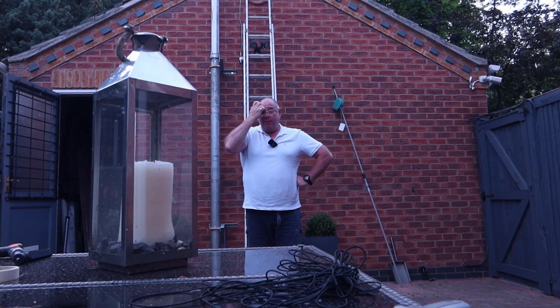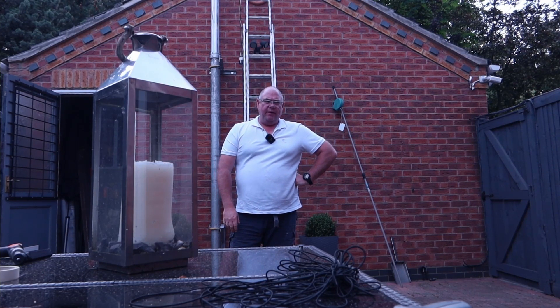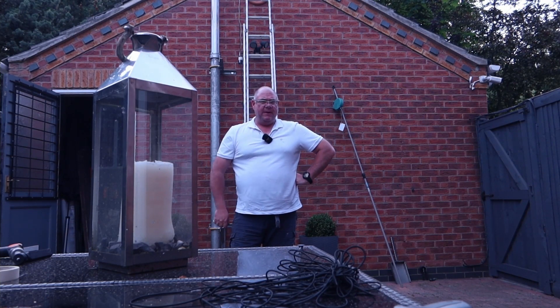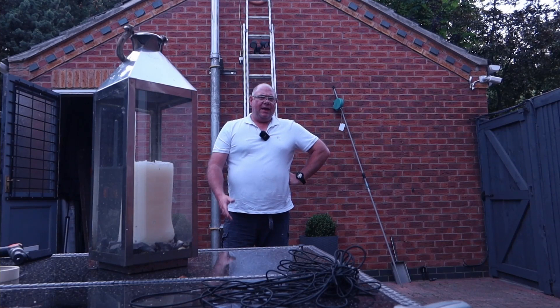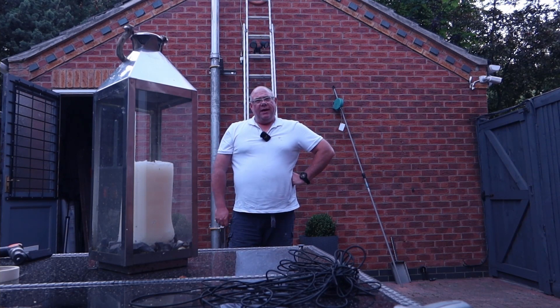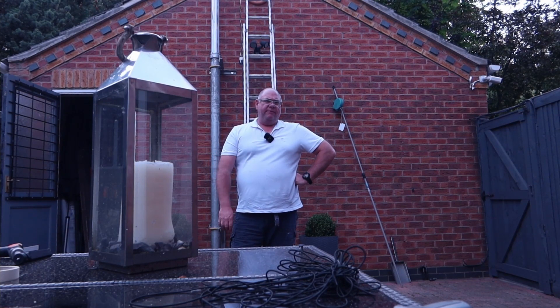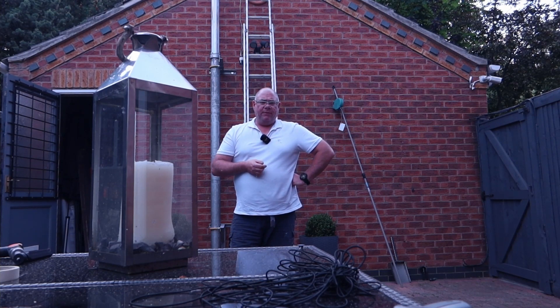I just thought I'd do a quick video to show you what I've been up to recently. For about the last month I've been refurbishing this mast behind me — it's 12 meters, it's pneumatic, and it's made by the company Hilo. I was given it by a good amateur radio friend of mine in a bit of a state, but it needed some love and attention. I've replaced all the seals, stripped it completely down, cleaned it all in petrol, had to get one of the sections remade because it was buckled, and tapped some new holes at the bottom for the bolts.